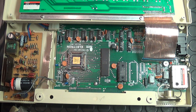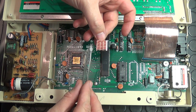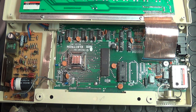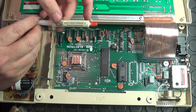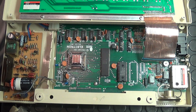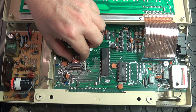What I've decided to do is put a heatsink on there. I grabbed one of my old PC motherboards — we've all got them lying around — and scavenged an old heatsink off it. I've actually trimmed it down and cut it to make it smaller so it will fit snugly on top of the ULA chip. Then I'm going to use a little bit of high-performance thermal compound paste, like you use on modern PCs, for better heat transfer from the chip to the heatsink.